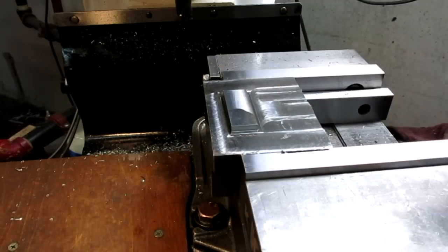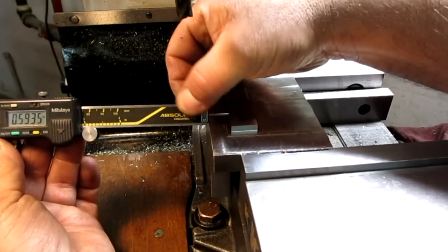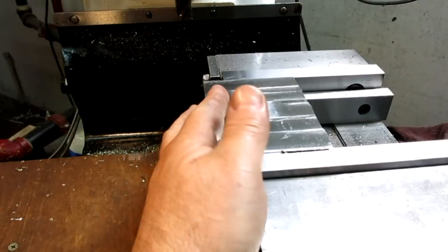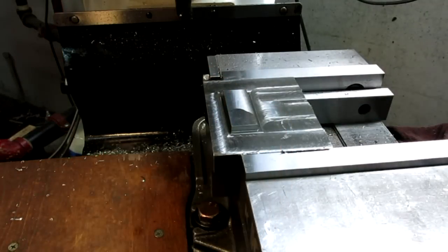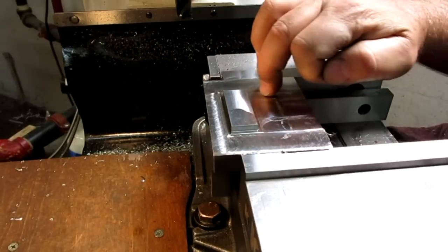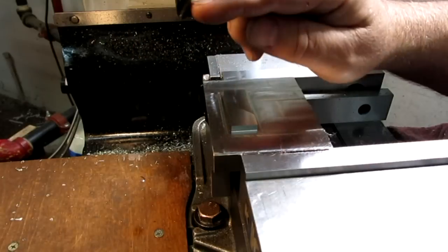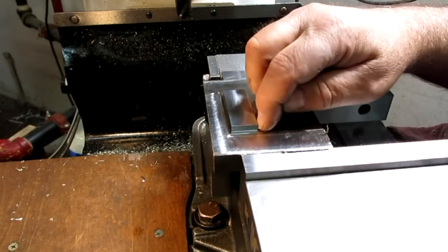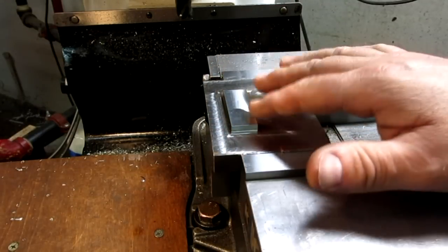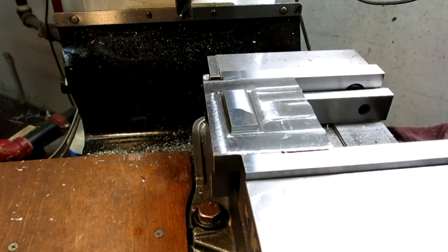Okay, that's cool. I deburred that edge, so I get a little radius on the bottom. Alright, it looks pretty close to what it's supposed to be. And I got about a half to 1 thou step from this end mill to the first end mill, which is fine. Do a little deburring on those corners, and then we can do a test fit on the pockets on the moving column on the jack.